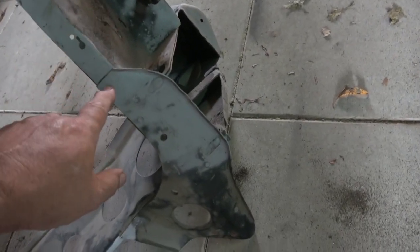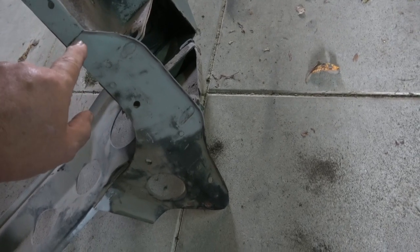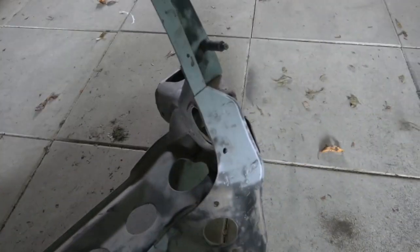So this is the subframe we're going to be using. What Sean's doing is sandblasting. We're going to sandblast the whole thing, but just now we're going to sandblast all these areas where there are really just tack welds on a few spots, so as to beef them up a little bit. I was speaking to Kevin Richardson, and he's going to beef up one of his subframes in the same kind of way. And I think it's from David Vizard, the Mini guy? What they're saying is put a little gusset in here, because these are bad for breaking in the corners. A little gusset there.